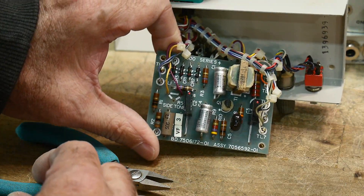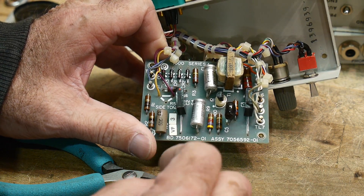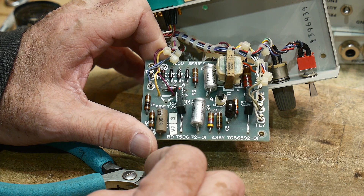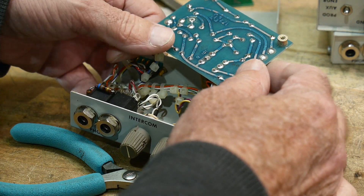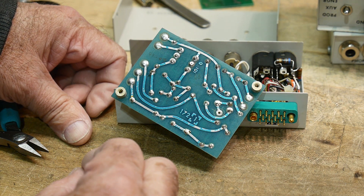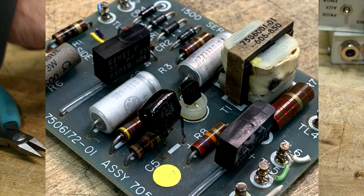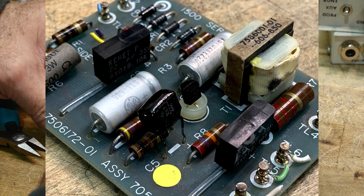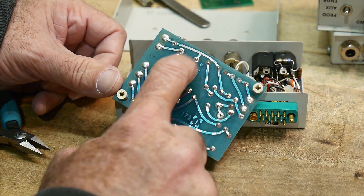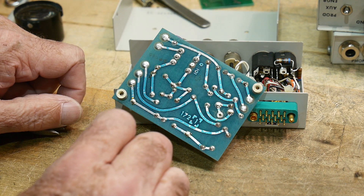That's what's inside — a single-sided board. There are little stickers here too: VP3. Maybe the vice president tested it at the company. Here's the back — a very cruddy PC board. I could probably trace the circuit out, but who cares. This is the transformer; looks like there are ins and outs, two on one side and two on the other side. So it's probably just a 600-ohm balanced transformer or something like that.